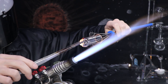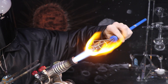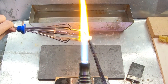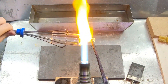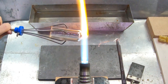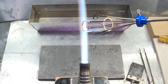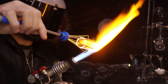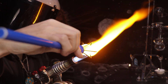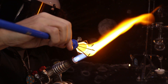With these multi-stage torches, you can really set whatever flame you need as your work gets bigger or smaller. Now that it's closed, I'm going to pull a little bit of glass very evenly out from the center. This is going to be the last thing I can do to even it out before I apply that very hot heat. And now I'll go ahead and liquefy the end of it here, so it can flow around more evenly.